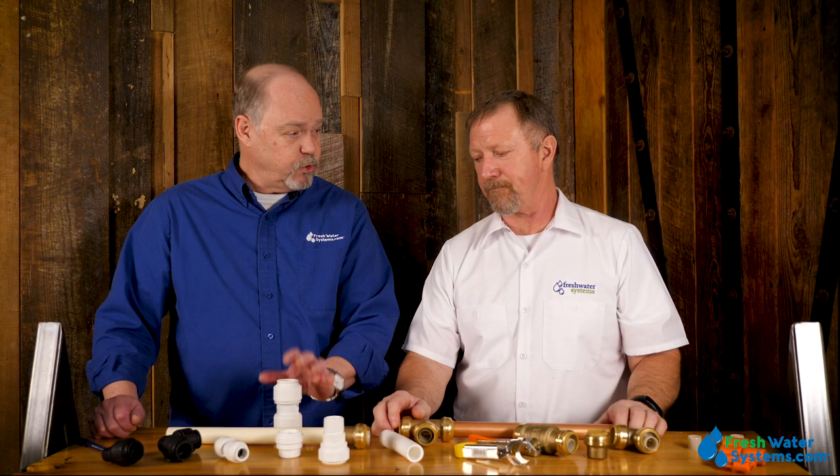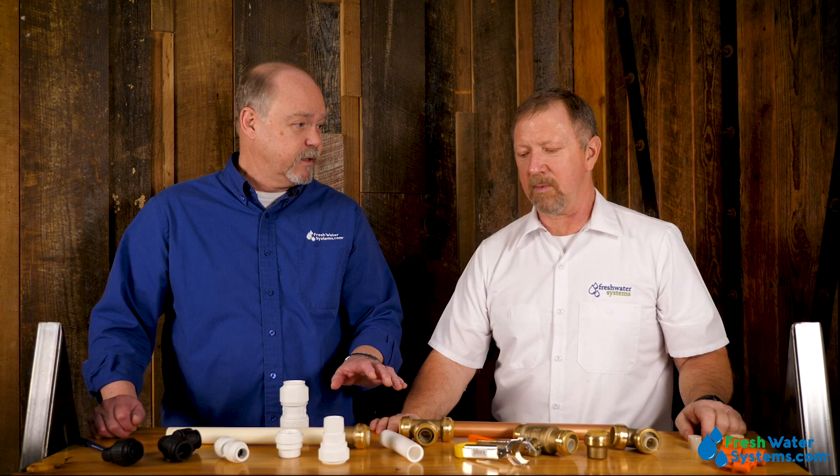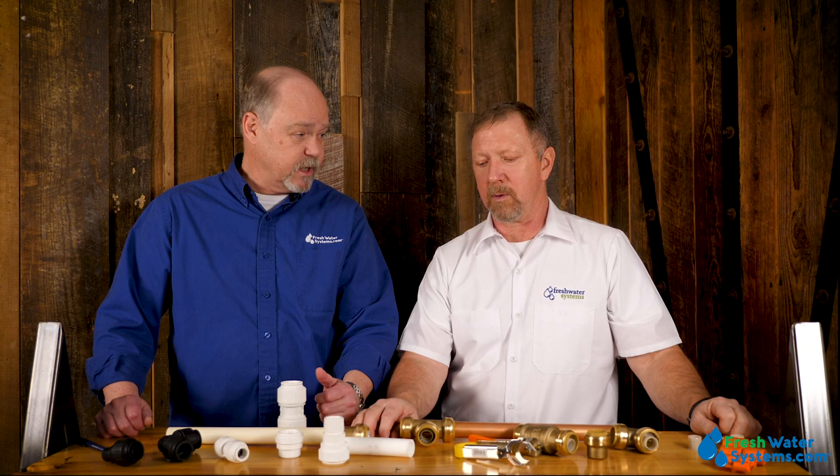SharkBite has been around for 15 to 20 years. Do you think it will last the test of time — can you build a house, use SharkBite fittings, and in 30 years still be comfortable those things are good? I definitely feel like they'll be reliable and can be used. One of the things I like about the John Guest ProLock is how you can replace that O-ring over time, but the SharkBite is so much easier to use than sweating pipe together. My personal experience with using them: I had great success and very few failures. The failures were application error more than anything — a burr on the pipe or a damaged O-ring.